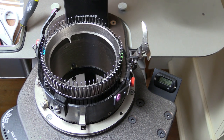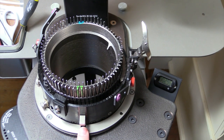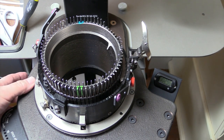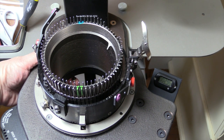To switch to cam shell mode I have to first disengage my cylinder. You want to rotate the cylinder until your green start needle is in the same spot where the front cam shell plunger is. I'm assuming you're using the markings set at the factory for both the start needle and the halfway point. When you get right here with your green needle next to the plunger, you're going to take your thumb and rest it on the shelf here.